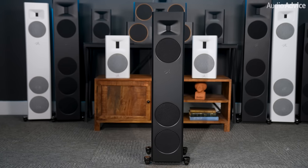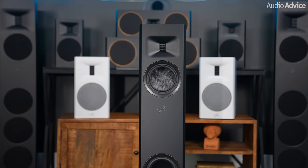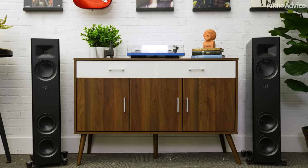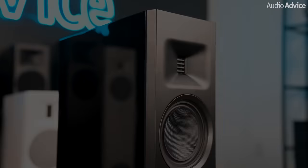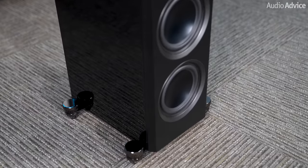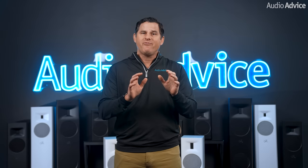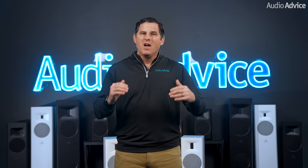The F10 is the first tower speaker but with a very compact footprint. You'll get the 5.5-inch woven fiberglass driver used for mid-range only, complemented with two 5.5-inch aluminum cone woofers. The impedance and sensitivity are the same as the B10 at 4 ohms and 92 dB. These do reach down far lower with a 3 dB down point of 38 Hz and can be bi-wired. With its very narrow front face, these give you as good an image as the B10 but with far more bass reach. Having the better foundation makes the lower mid-range sound a lot better, and I felt across the board that the F10 just sounded more musical than the bookshelf. The bottom-firing bass port makes placement extremely flexible since you don't have to worry about it firing into a rear wall — you can put these pretty close to a wall with no boominess, although they still sound best a bit out into the room.